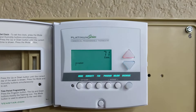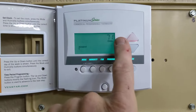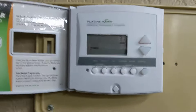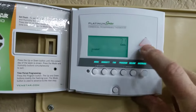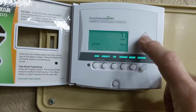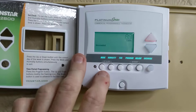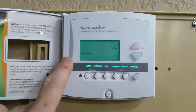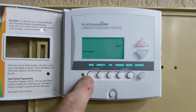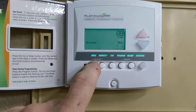In case you just needed to change the temperatures, this is your time to do it. Right now the cooling set point is 71. If you had to change that, you would just press these buttons. If you had to set the heating, you'd press those buttons now and set that. Then for the unoccupied setting — when no one's here — I have it set for 88 for cooling and 53 for heating.